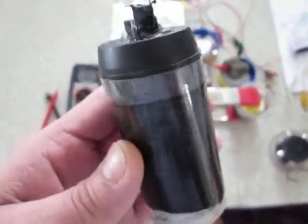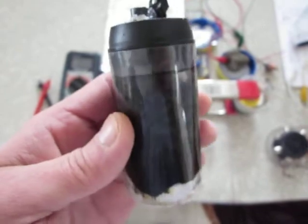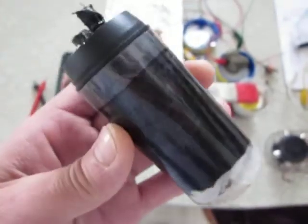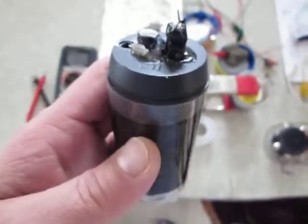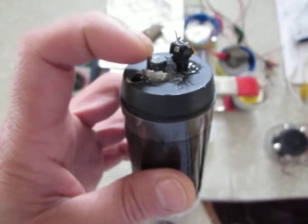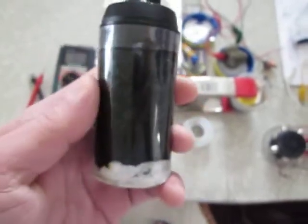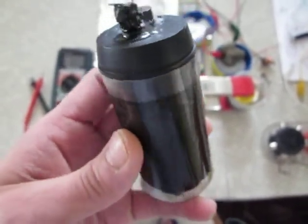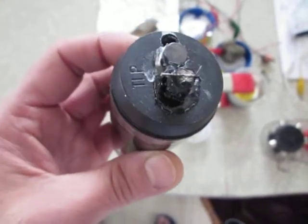Hi folks, this is Vitek here. I have one of the cells I built a few days ago. It's a plastic tube filled with active carbon I got at Walmart. I use the carbon electrode from an old six-volt battery and a magnesium rod — it's a flint fire starter from Walmart as well. The electrolyte, as suggested by John Bedini, is a 50-50 solution of alum and borax.